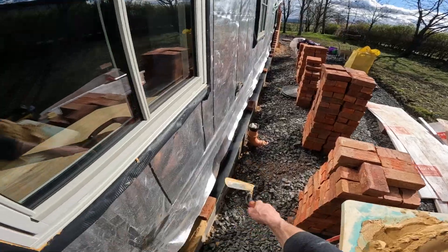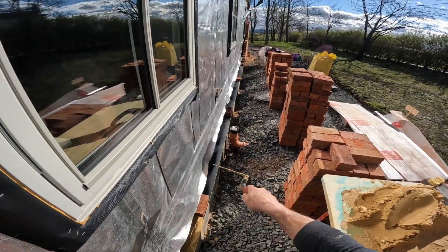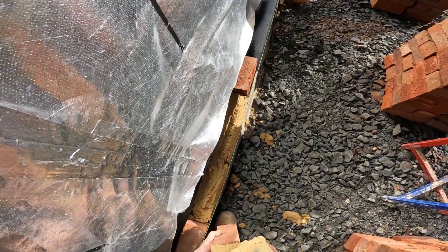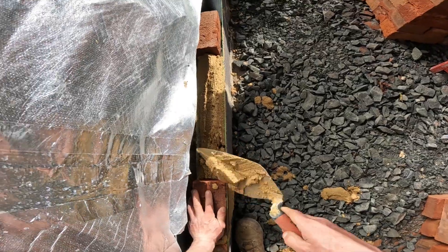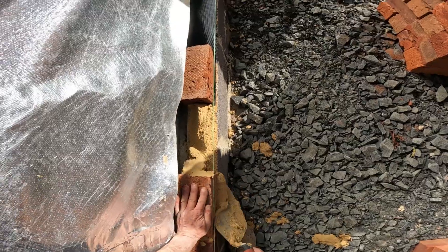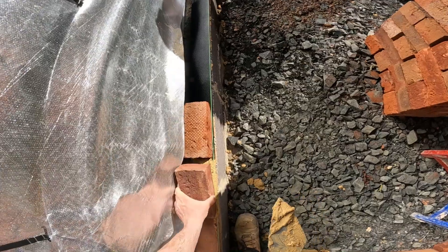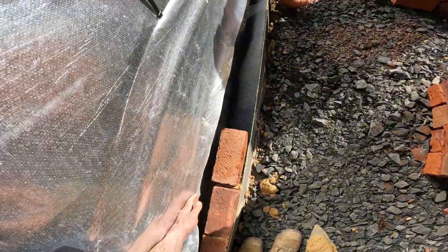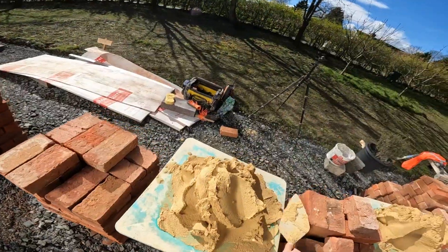So what you can see I've done here — see these bricks that I've dotted along, these three bricks through there — I've traced the bond back. So each of these are eight bricks. Traced the bond to the corner behind us there and we found we need to open up 40 millimetres, which is fine to get that to work. Because it's like 40 bricks or something in a stretch. And I've nearly got it already — I've got it! That's why it's always best to tape out. They work.